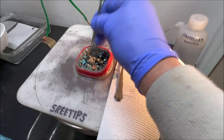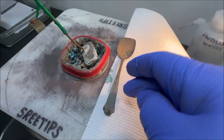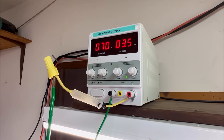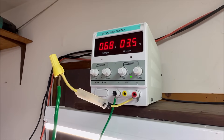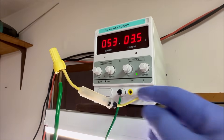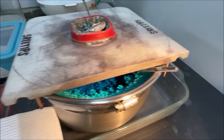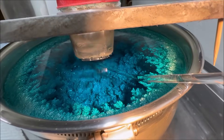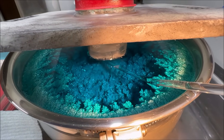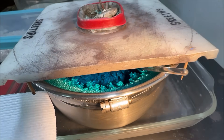I've still got the cell running right now and we'll continue to let this run. While we're getting set up to harvest the pure silver, you'll notice that I've got a fuse installed. I do that on the last several days of the silver cell operation. This is an inline automotive type 3 amp fuse, and that's there in case the pure silver crystal growing inside the cell makes contact with the anode basket — it'll short it out and burn a hole in that filter bag, releasing all the impurities into the silver cell and ruining the batch.